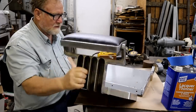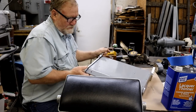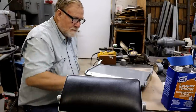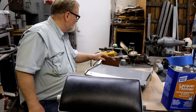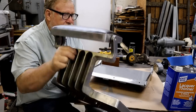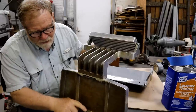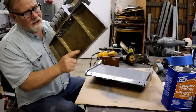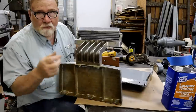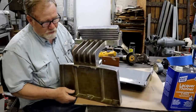Okay. Lift this up in the air a little bit so that the bolts can go under. Hope y'all can see enough. I'm going to get some better bolts and I'm going to make some washers that are tapered so they'll fit here. I could take a grinder and just grind it down to flat, but I want all the strength there is in this little area. Well, you can't see that. This piece here is tapered, and when they put these bolts through it in the first place, they bent the bolts because they were pulling it up tight against those nuts on that taper. So I'll make some little flat washers that are tapered to make the nut fit on there straight.